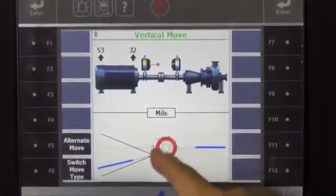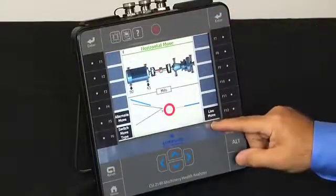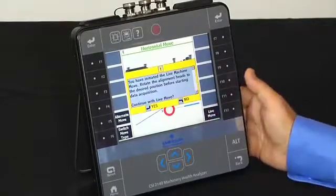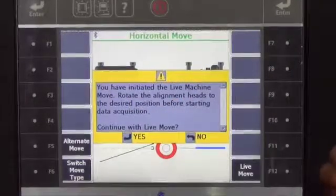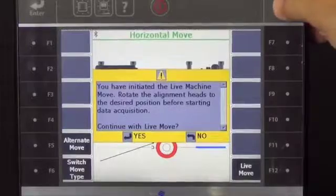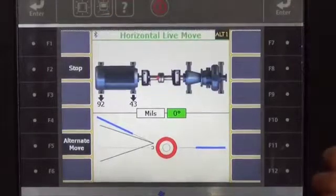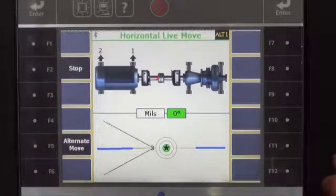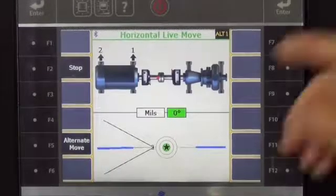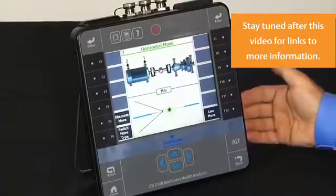The red ring indicates that we're far out of optimal alignment. In the horizontal we have the ability to switch to a live mode. I'm going to press that key and it tells the user to put the laser heads in the position where you want them during the live move and press enter. When I press the start button it will automatically simulate the movement of the machine, and you see it going from the red to the yellow to the green and then finally to the green with a star — meaning we've actually achieved excellent alignment relative to the tolerances. We press stop and that concludes the basic demo.